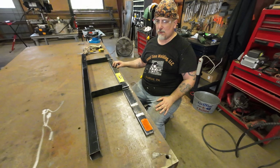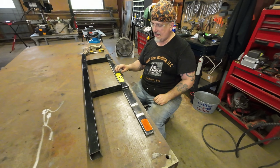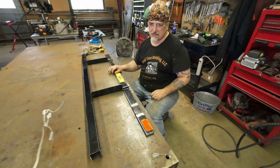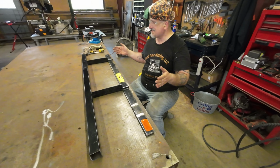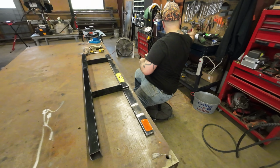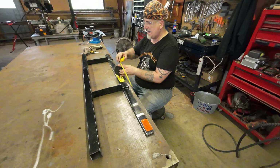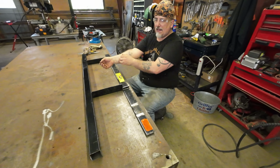One of the things I noticed, on the trailer right now, any ends are capped off with plastic caps. And I went through it and measured those caps, and they're about an 1/8 inch thick. So that this isn't tight in that gap. I mean, we've already got the thickness of the cutoff wheel, which I think is a 16th. Let me double check here. Part of the tape measure I can actually read. Yeah, so these are about a 16th. So we've already got an 1/8 inch gap. But I'd rather have a 1/4.